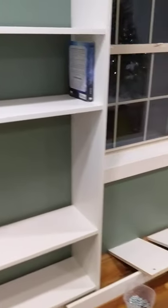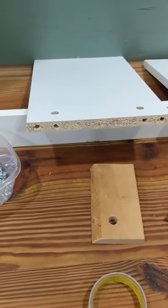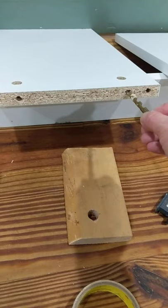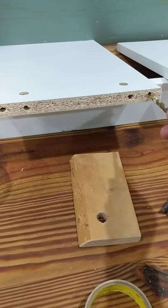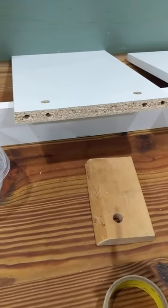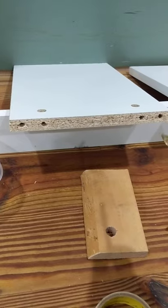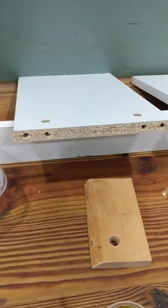I just didn't want that issue, and it would not be quite as stable as having good solid dowels holding it together. So we tried drilling holes in the ends, just lined them up carefully and drilled the holes. We used a 19/64 drill bit for the dowel holes and that worked perfectly. We put tape on the bit to mark how deep it needed to go so we didn't lose our dowels in the wood. We did have a couple of shelves at the very end — getting a little tired — where we didn't drill in exactly the right place and had to wiggle them in. Just be careful, mark them really carefully, drill really carefully, and take it slow going into that particle board so it doesn't rip up too much.